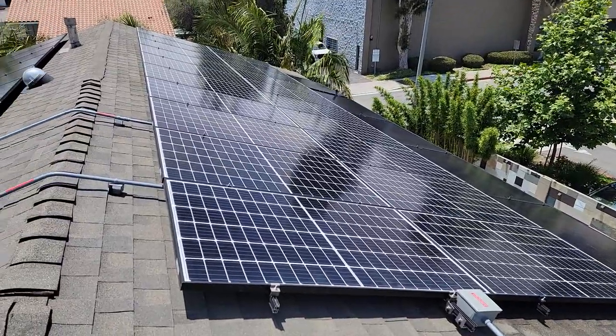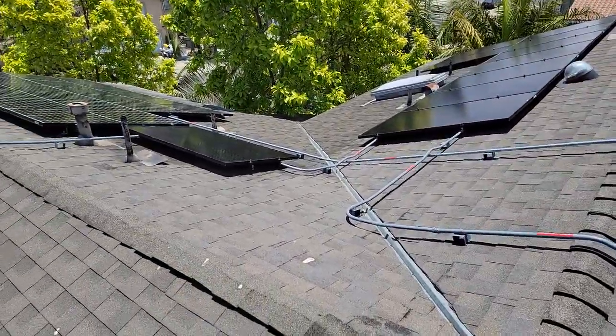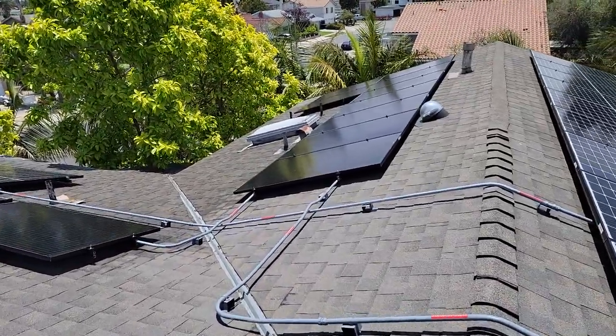There are a lot of people out here that use soaps. As you can see, we have quite a few solar panels up on this roof right now — about 46 solar panels. We want to talk about cleaning them the right way. We want to use deionized water only. The reason for that is if you use any soaps or any chemicals, that's going to void your warranty. And a lot of you guys are leasing your solar panels.